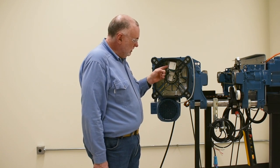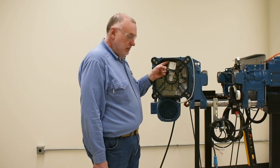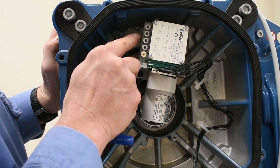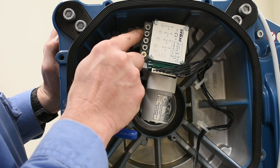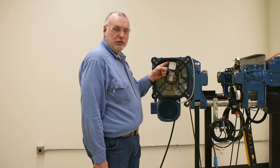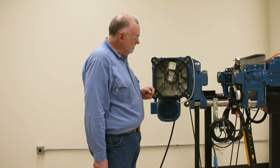There are four separate switches — number one, two, three, and four — built in. Number one is the emergency upper limit switch. Number two is the operating upper limit switch, which is the slow down point when lifting. Three is the slow down for lowering, and four is the final lowering limit, which we normally set about six inches off the floor, so the hook won't crush the top of a steel toe boot. It comes from foot safety.